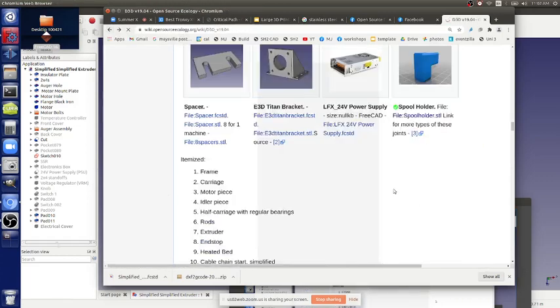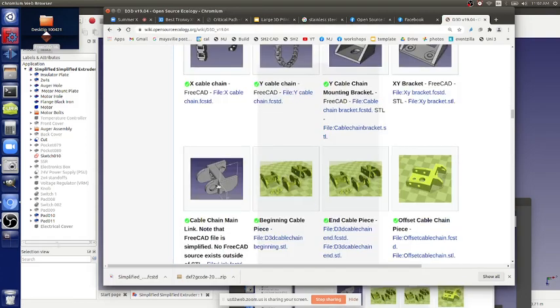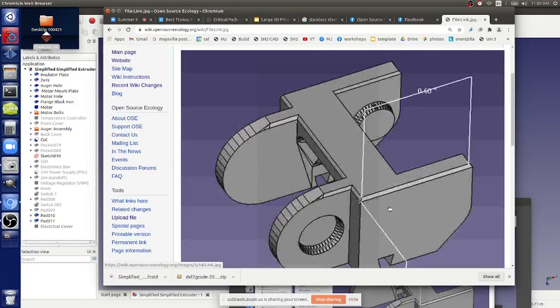I don't think we want what we have here, which are these things. They're way too massive. We can redesign a very simple version of that: things that snap into each other and they can rotate. That's a simple redesign. I was actually thinking of just using a screw, since this is hard to print because those pegs are against gravity. We've got plenty of those black screws, at every joint you've got this screw. So put holes into this and put a little pin screw. It'll be very strong and easy to print.